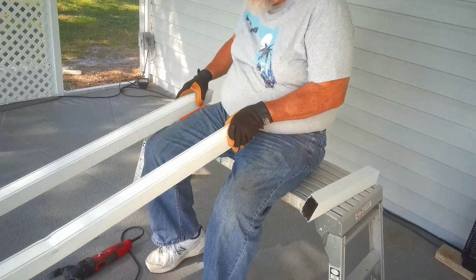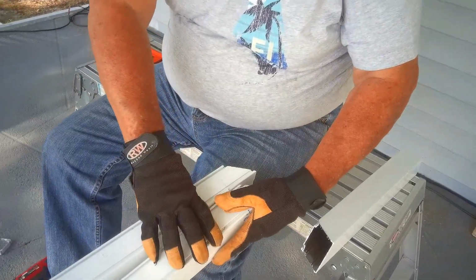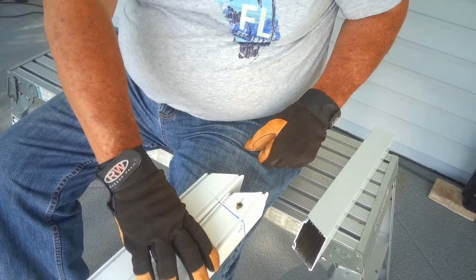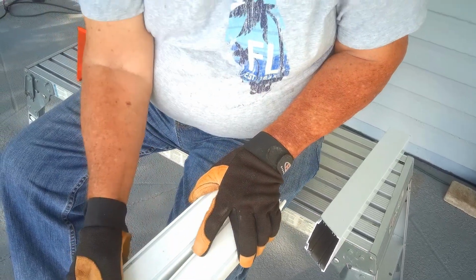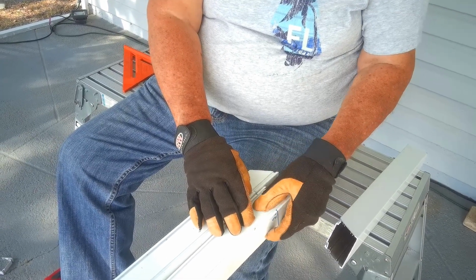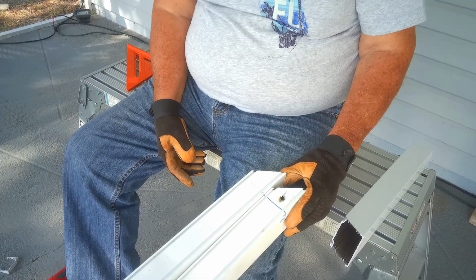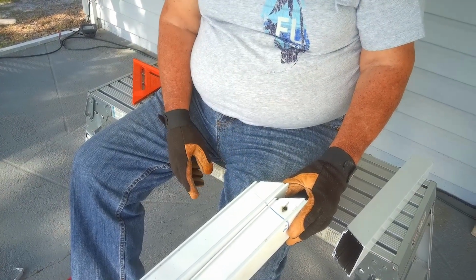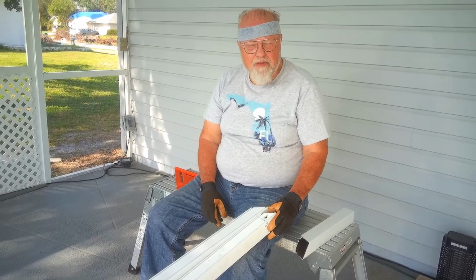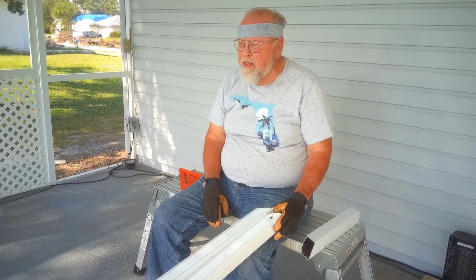And if you take a look here, you will find these two ends appear to be the same, although obviously I need a hole there. I have recreated a straight one. I've tried this bent one, I've straightened it out as much as I can, but it's bent, and so I cut the ends. Now the next thing, hopefully I don't need a brace stretcher, but I'll adjust the angles to fit with a flap grind, basically an angle grinder with a flap disc on it. So there's how I recreated the brace. Now I've got to put it up, so we'll see what happens.